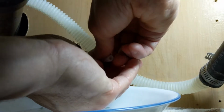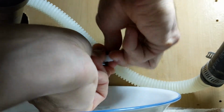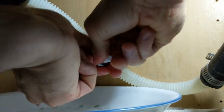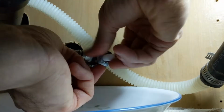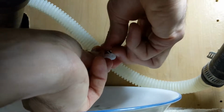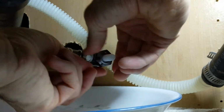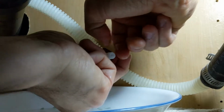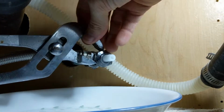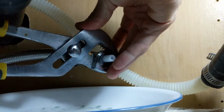Ah, blast. Okay. That is not really going on there. I think I need to sink that washer down inside the nut there real quick. That's why it's not really going on. I think I got it now, but the washer was kind of a tight fit, so when you put it on there, make sure you snug that washer down in the nut and then do it. Alright, we got it though, I believe. And we'll simply tighten this on with our channel lock wrench.